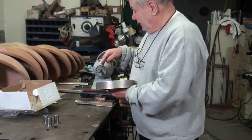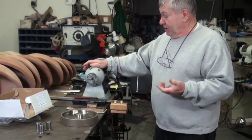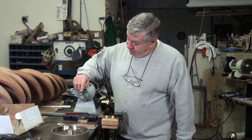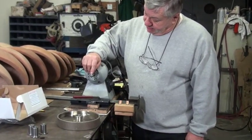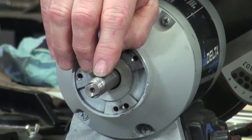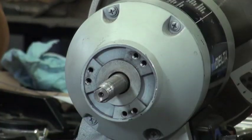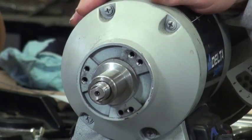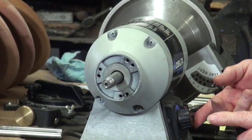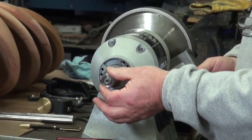Now we're going to go ahead and try to install it on this grinder here. The only issue I have with people trying to install these is right here — sometimes there is a burr right here where this shoulder starts. What they do when they cut these threads, they don't clean up the shoulder. So if you take this bushing out of the wheel, you want a nice slip fit on there. If it doesn't nicely slip fit, just turn your grinder on, take a piece of sandpaper and clean this shaft up a little bit until this slides on there.